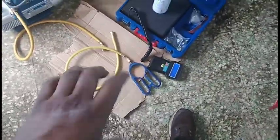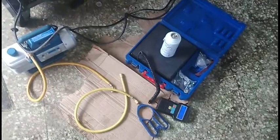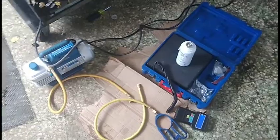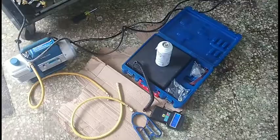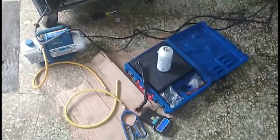The vacuum is going, so a charge is coming soon. I'll get the scale and the can. Now, this was crazy — I didn't show it because when I punched the can with the piercing scissor, it started leaking everywhere. So I had to charge really fast. I put it on the scale and got close to the four ounces I needed. It took almost the whole can, so I'm confident I got the charge in.